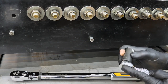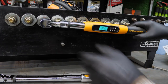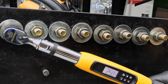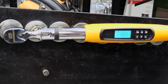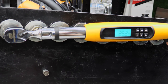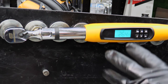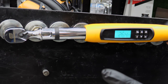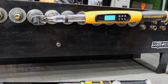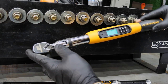Let's throw a socket on here. I've got it set at 25 foot-pounds. Let's put it on this fastener and see a few things happening. Now I'm getting really close to my torque window there. So three things are happening: number one, I can see that I'm at 25 foot-pounds; number two, I can hear it; and it's also giving haptic feedback — in other words, it's vibrating the handle so I can hear it, see it, and feel it, and also see the red light. It's giving me my peak torque right there as well: 26.4 foot-pounds.